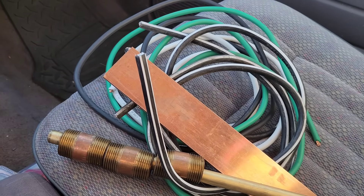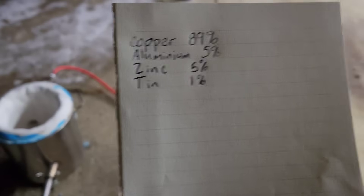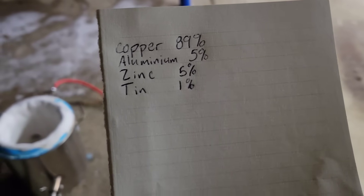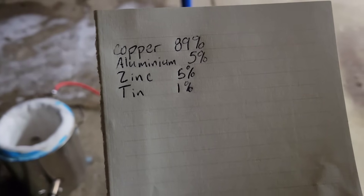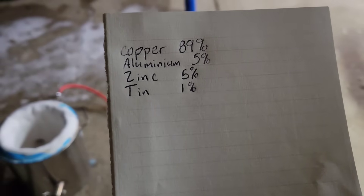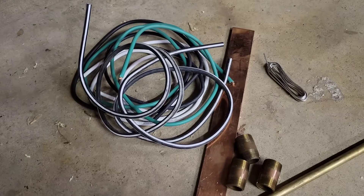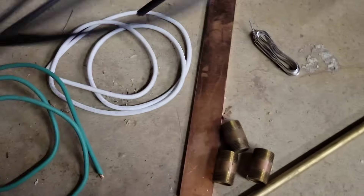Let's take it back and get the melt started. The formula to make Nordic gold is about 89% copper, 5% aluminum, 5% zinc, and 1% tin. Copper and aluminum are pretty easy to find at scrap yards and we got a bunch of that. However, zinc and tin are not usually easy to find at scrap yards, at least in pure forms — there might be some alloys. In pure forms they're not very easy to find.